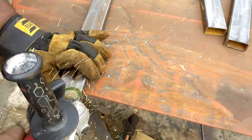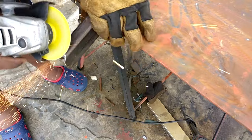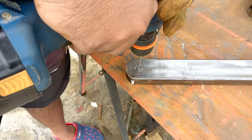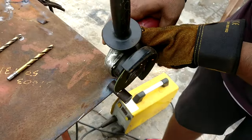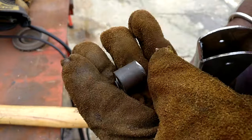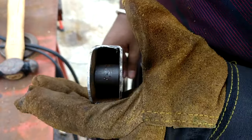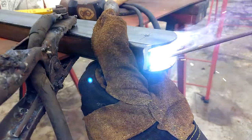To provide nice support to that pin joint, I decided to weld a bushing inside that pipe. After cutting the bushing, you can see how I'm going to install it inside the pipe. After that, I take the reference from the previously drilled hole and drill through the bushing, and you can see how this leg is going to be installed — you can raise or lower it according to your need.